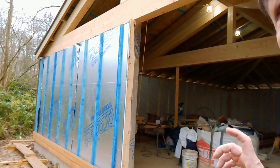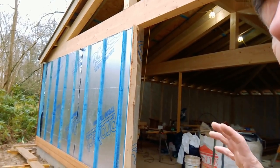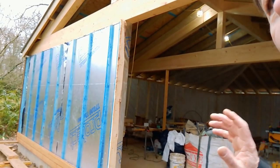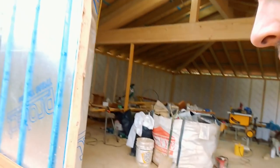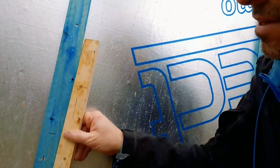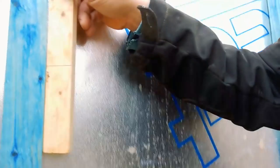What people have a tendency to do when cladding is to jam it all together, but timber is naturally going to undulate as soon as it's machined, dried, and treated — it's going to move. So you've got to pull and push it straight. The key is pinging some datum lines across. What I do — rather than doing the whole lot, which is laborious — is a combination: every fourth course I string a line, then I use a small gauge stick like this. On it there's a series of measurements; it sits on the datum line, butts down against the cladding, and you repeat the process and carry on up the wall.